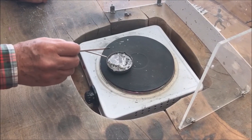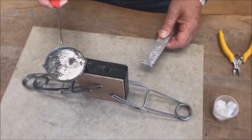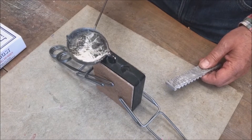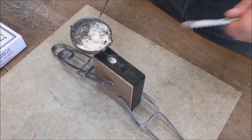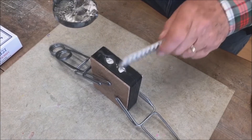Scrape away from the side you are planning on pouring from any slag or scum so that this will not end up in your mould. Rest the ladle on the mould then when pouring it into the mould tap it firmly with something solid. This helps remove air blockages and improves the casting results. You can pour the second one afterwards — give a little time between each pour.